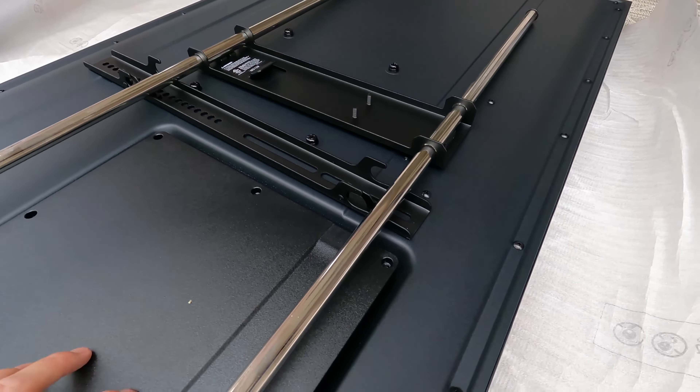We're going to get it lined up. We know where we want the bottom of the TV, so we're going to measure from the bottom of the bracket to the bottom of the TV, which is three and a half inches. The customer wants the TV one brick higher than his little hooks. We've already marked the center of the wall, so we're going to do three and a half inches up from right here — that'll be the bottom of the bracket, center of the bracket. We've marked out the edge of the TV as well. The reason I want to point that out is because we're going to be tapping into electrical, which is going to be a fun little addition to this video. A lot of you guys have new construction homes and won't have to mess with this, but for guys with older homes or maybe you're not wired, you'll appreciate this — a little insight into electrical.